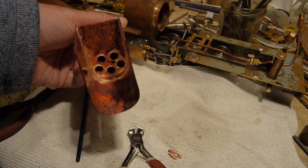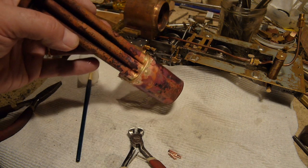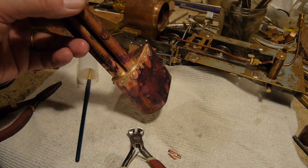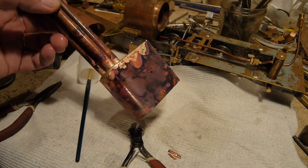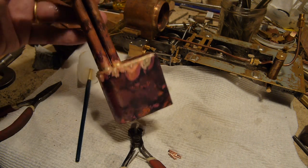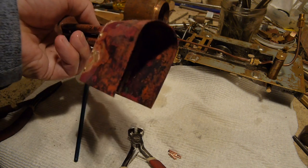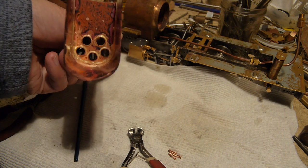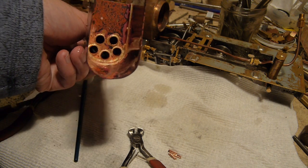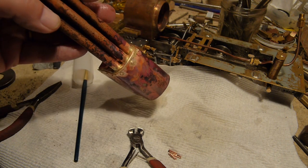That's the job silver soldered. I think I've got good penetration — it looks pretty good. This is before I've cleaned it up in the acid. You can see I've put plenty of silver solder all around the joints, around the rivet heads, around the tubes. I did it all from this side and it's penetrated into the seam and around each of those tubes. That looks pretty good — let's go and dump it in the acid.